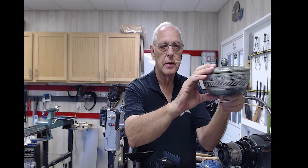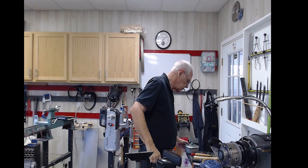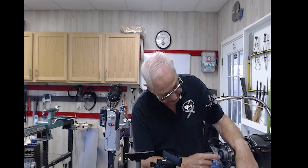I have a question. The center spiral that you used on at least the first piece, you're using that short handle. I'm using the small Robert Sorby tool. Is it beveled on both sides? No, it's beveled only on one side. And what's the difference between that and the one beveled on both sides? The one that's beveled on both sides gives me all these little dots.